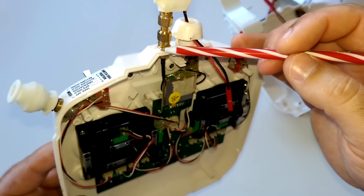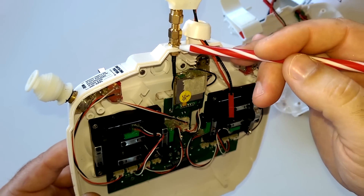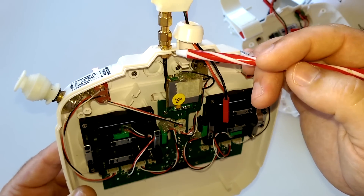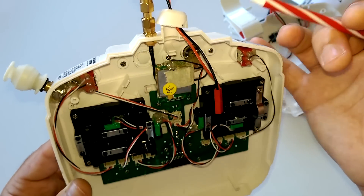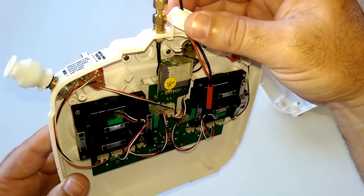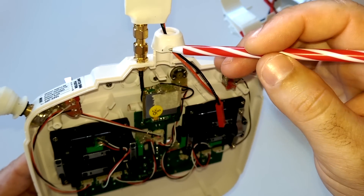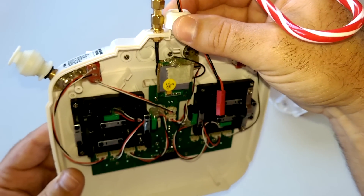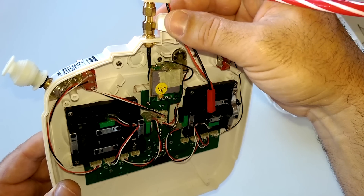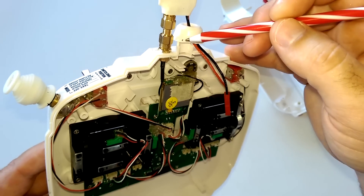Snug down these nuts. I put just a tad of super glue on here because it was kind of twisting and moving a little bit, so just a dot of super glue to hold it so when you're flying you don't have this thing unscrewing by accident — and you can always break this bond if you really need to get in there. This is the stock retainer clip for the top, and what I did is cut a little notch in it just so it kind of hugged the antenna connectors nicely and you're able to slip it on and off.